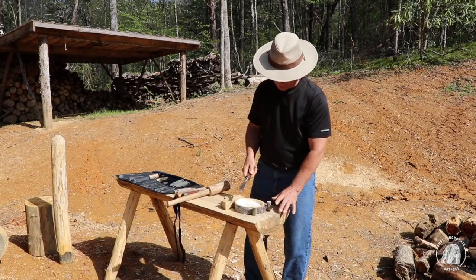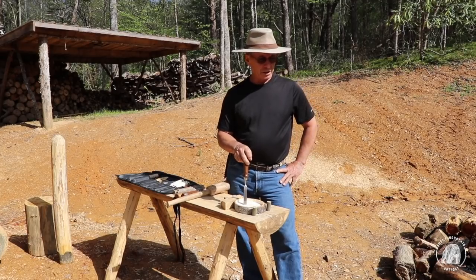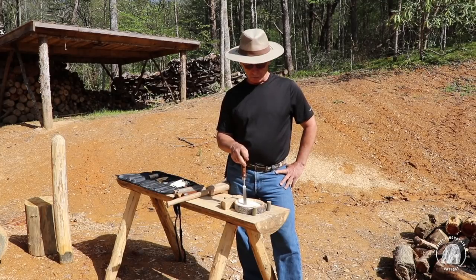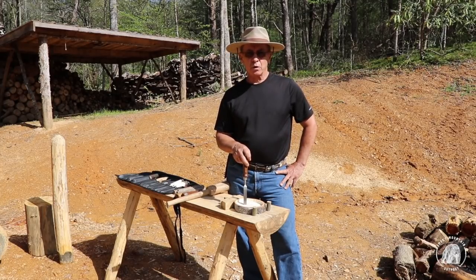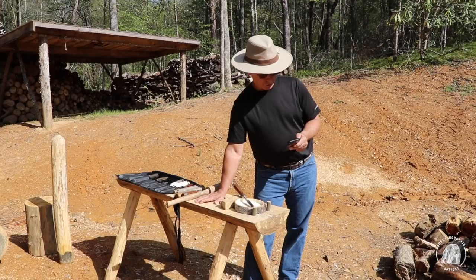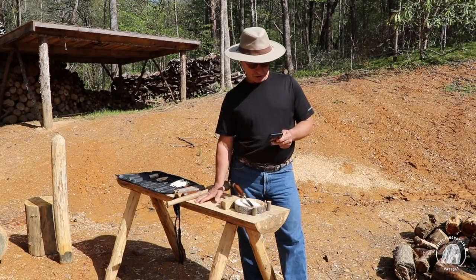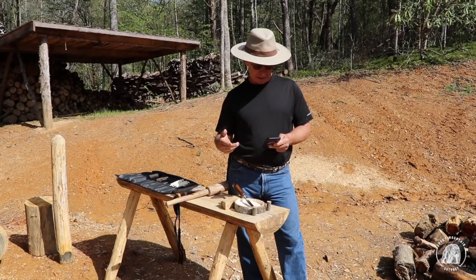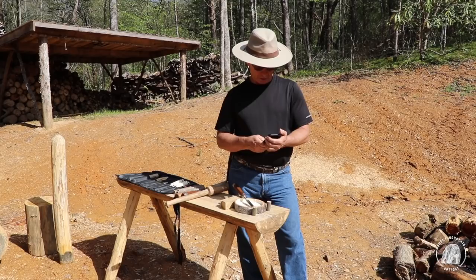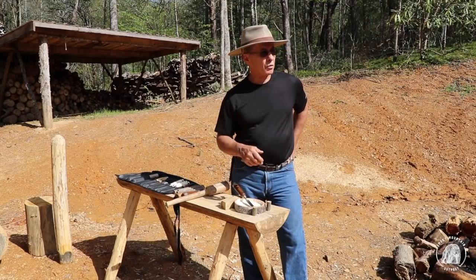So far, I'm really pleased with that. I had some comments from a guy who called it Q8, that he had got from a builder from Western North Carolina that did some cabin refinishing, and it really worked good on their logs. One person wrote that they had stained a cabin 30 years ago and used a product called Sikkens, S-I-K-K-E-N-S. It's a two or three part epoxy stain, and the owner told me that it has held up well over the years in Maine. So there is another product that is good to be used for something like that.